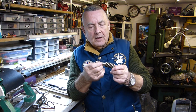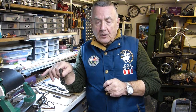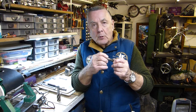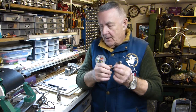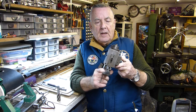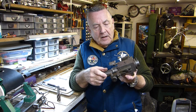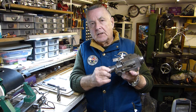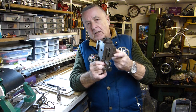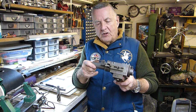The way I do my end mills and slot drills — end mills especially — is done between centres on the homemade tool and cutter grinder. I also grind my slot drills on a sliding bush. It's an attachment I made — you can actually buy something similar, but the best type to get is with air bearings and it'll slide in and out. It's a special technique for grinding slot drills and can be a bit tricky if you're not used to it, but I'll show you how it can be done — you could probably make one of these yourself. There's no mystery about them.